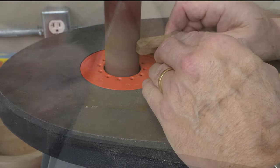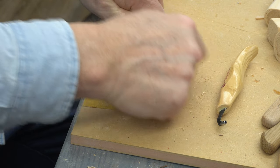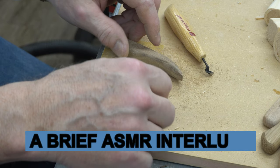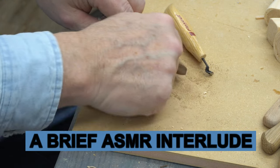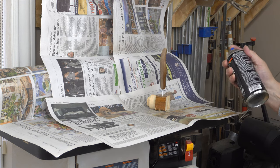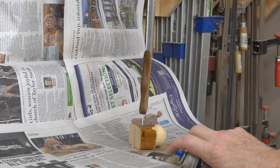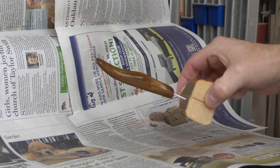When the rough shape was ready, I moved back to the bench for some finish sanding from 150 down to 220 grit, taking my time on the inner and outer curves to remove any of the rough sanding lines. Once it was smooth and felt good in the hand, I was ready for a hard finish. I wound up choosing a spray lacquer finish on the handle because of the fast dry time. And though the original FlexCut tool handle was made from ash, I think the custom shaped walnut looks pretty awesome.